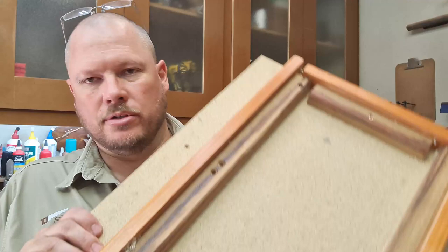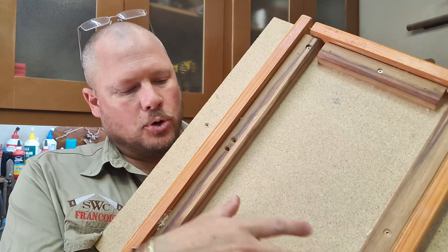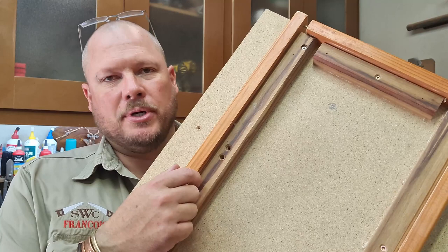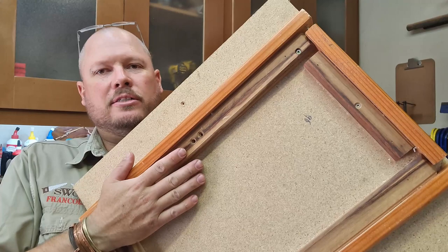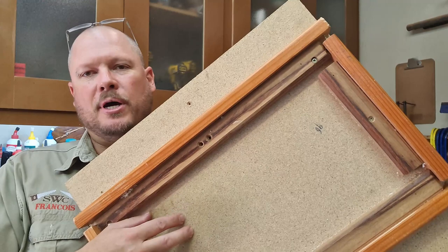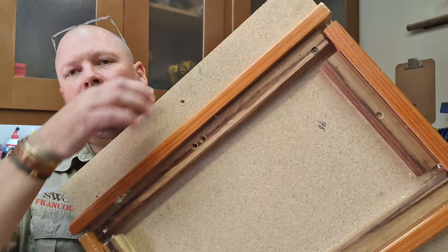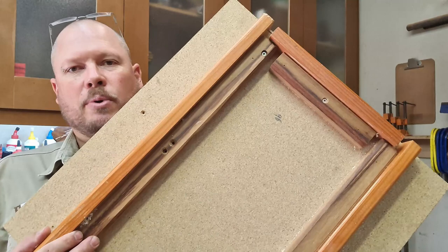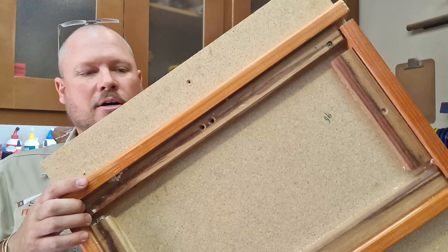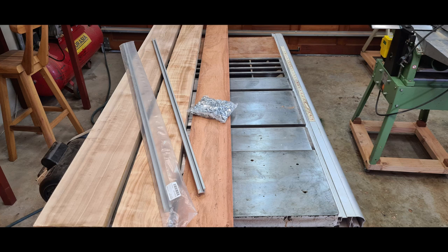Also, between the bigger and the smaller cutting boards, the distance you want your groove from the edge differs. You'll see on this cutting board it's quite close to the edge, and on this one it's a bit further. This is the jig I'm currently using for my smaller cutting board. You can see you have your guide on the center — this distances your board from the side. If you want to adjust this board, you have to remove all the screws, align against the board and tighten them. The press wood at the back I've replaced a few times and the screws are getting stripped, so it's not very quick to adjust for different size cutting boards.